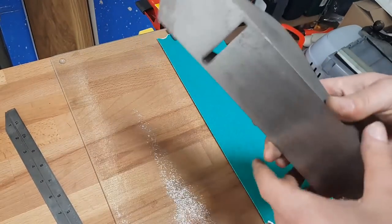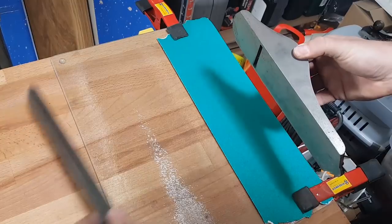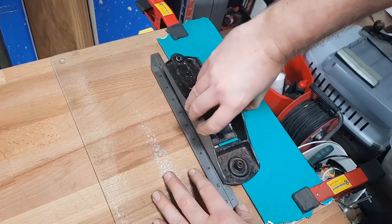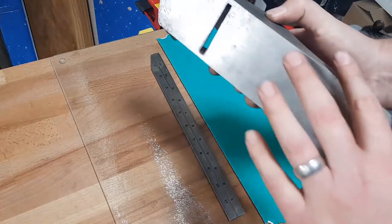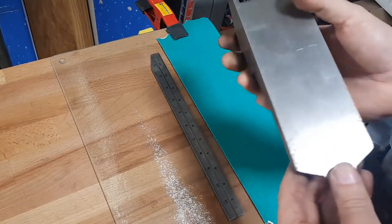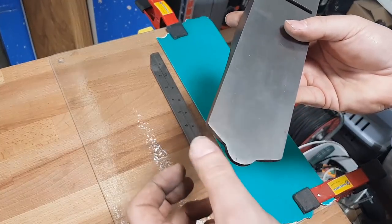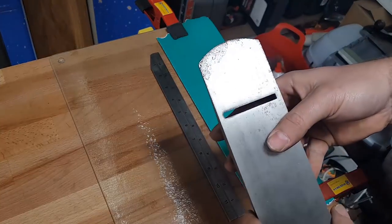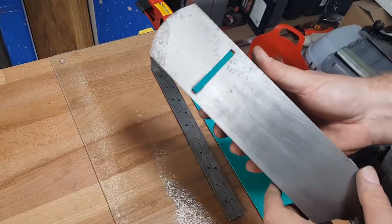Now I'm going to clean up the bottom and sides of the base. You'll also see me elevate one side and then the other — this just stops any sharp edges on the plane when you come to use it. I'll also take a file later just to the edges and soften them off, which again stops any marks when you come to use it once it's reassembled.